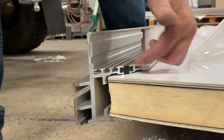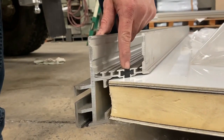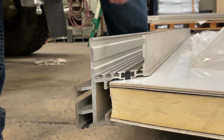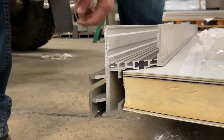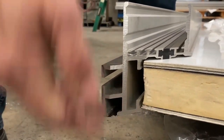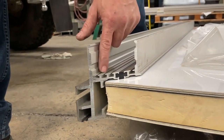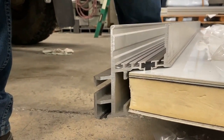Here's a cross-sectional view of a corner assembly. You can see the thermal brake, the glued pockets where we're going to put the Sikaflex, glue capture pockets, a wire channel, the 80-20 corner cap, glue channels for the vertical walls, and load variance channels for the wall to sit on — these also lighten it up but keep everything strong.